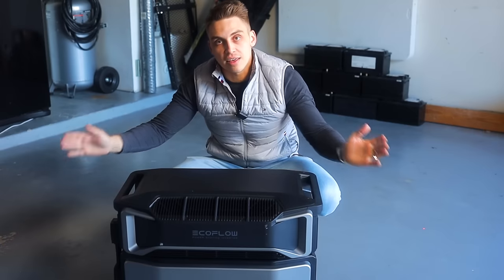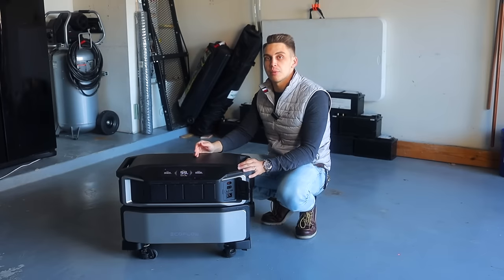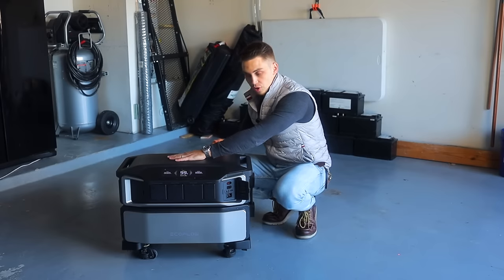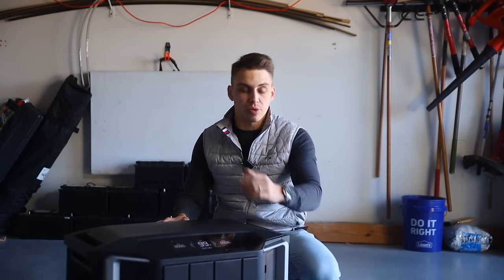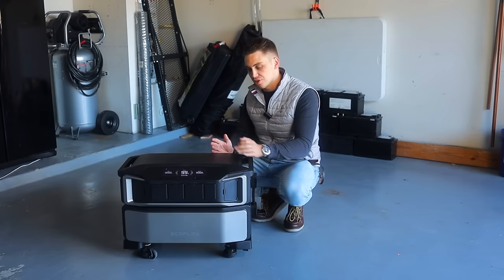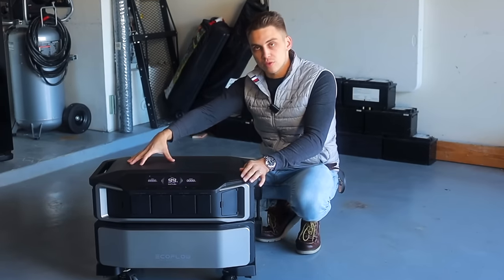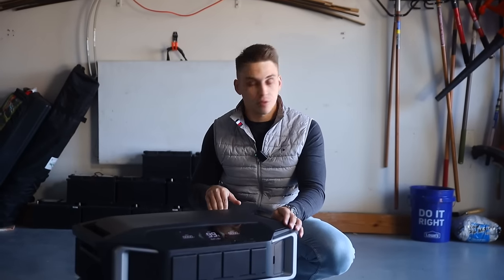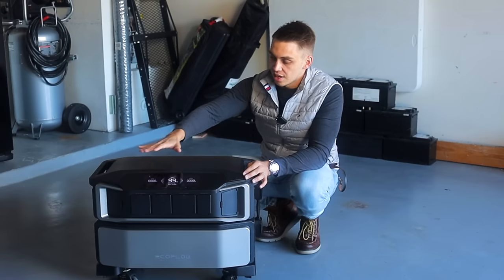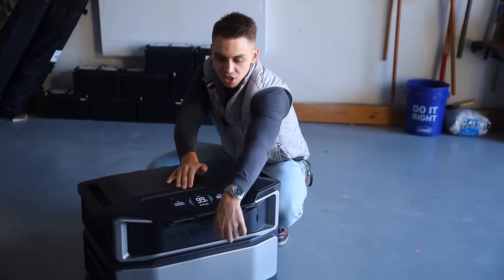So what is X Fusion all about? Before, when charging and discharging simultaneously, you were limited — if you input 1,800 watts from a socket, you could only withdraw 1,800 watts from the unit. X Fusion means you no longer have that withdrawal limit while charging, because the inverters complement the missing power. You can still charge with whatever wattage from 120 volts and simultaneously use the full output spec of the Delta Pro Ultra — 240-volt output, all outlets loaded, 7.2 kilowatts — no problem.